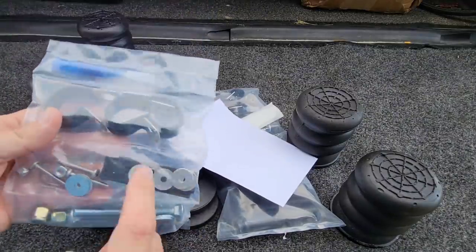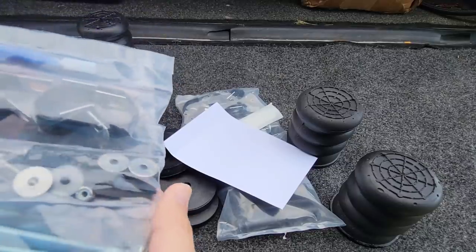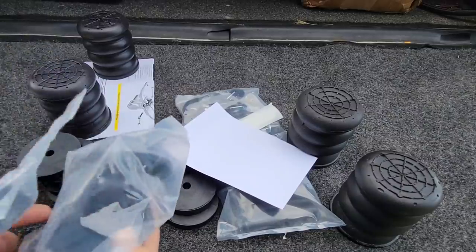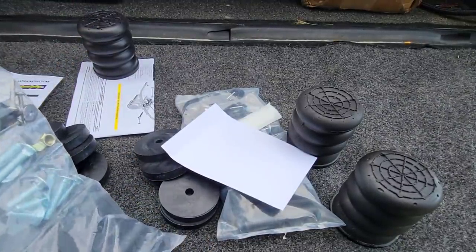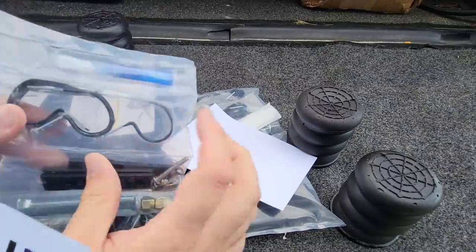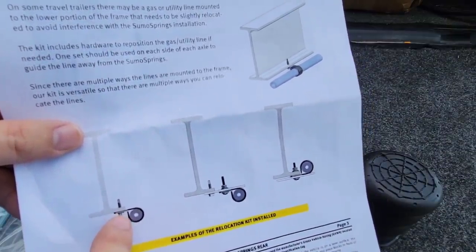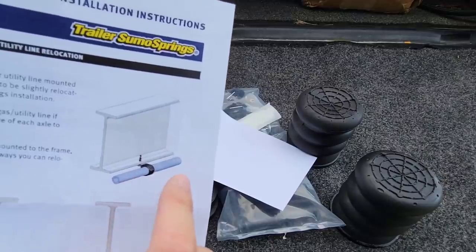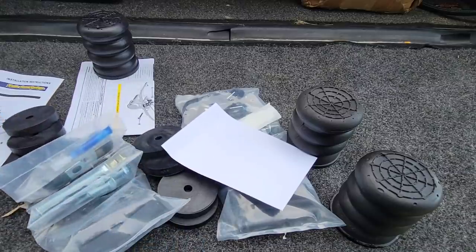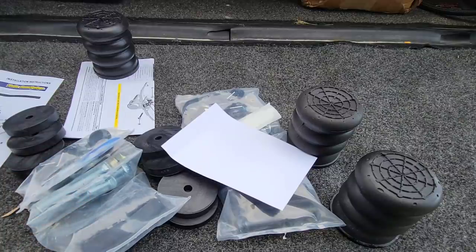Let's take a look at what's supposed to come in these accessory packs. We have some thread lock, some brackets, some spacers, washers, some bolts, and then we have the clamps right here — two of these, a half each for each one of these bushings. After looking at the instructions, these flat pieces of steel are actually relocation brackets for your gas or utility lines. On some RVs you have a propane line running underneath your frame, and these space it away from the frame so if that's where the bushing makes contact, your propane line is out of the way. It shows they put a lot of thought into making this kit fit more than one type of RV across various brands, manufacturers, and frame types.